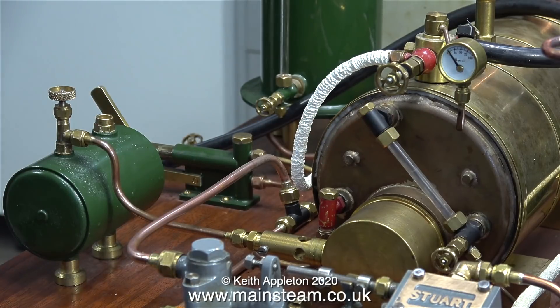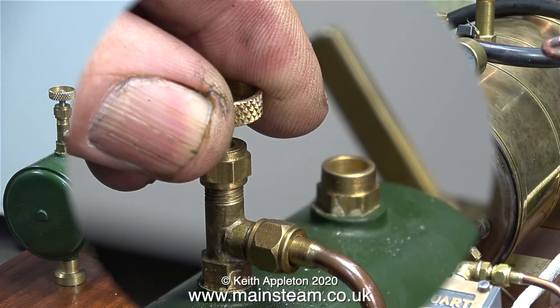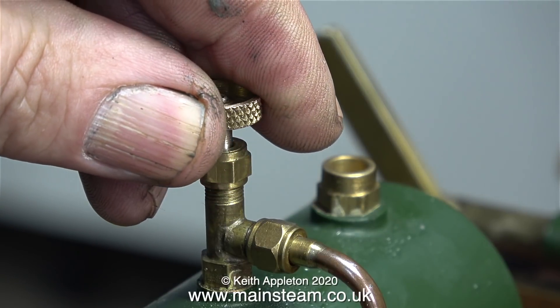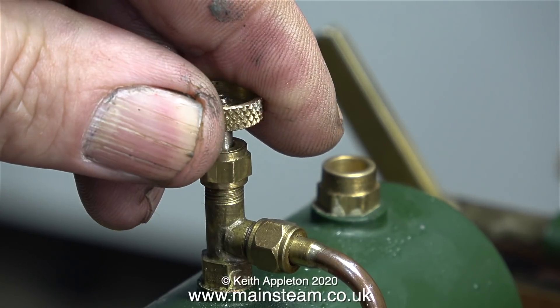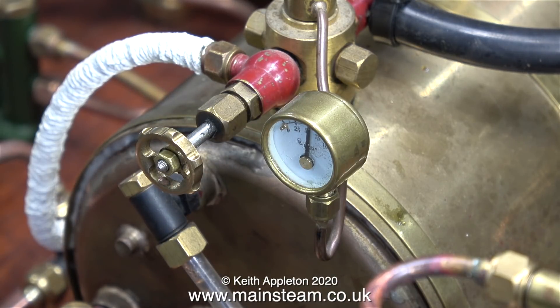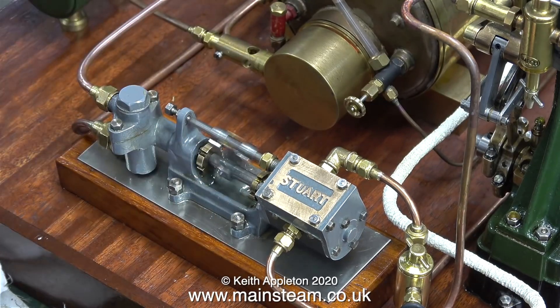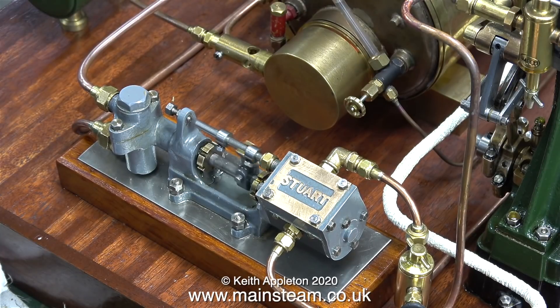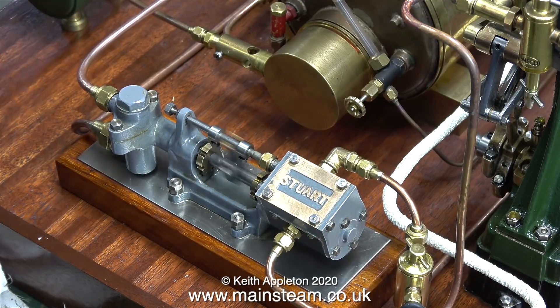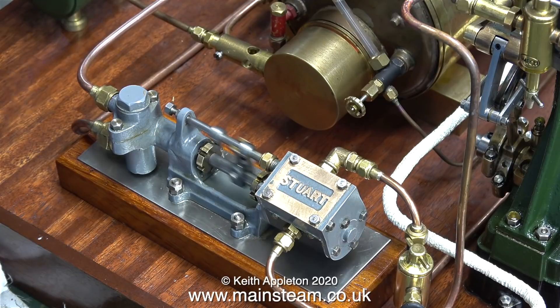It's not howling quite as bad, but the smell from the chimney isn't good. Turning down the gas doesn't work either, because owing to the jet being too big there's insufficient pressure and therefore even less oxygen over the fire. It even set off my carbon monoxide alarm — nothing new there then. I'm hand-starting the pump because I've just raised steam again, to get rid of the condensate in the steam cylinder. There's no longer any water in the tank — that's why it's going so fast — so I thought I'd run it really fast just to make sure it didn't break. I always test run things at a very high speed.